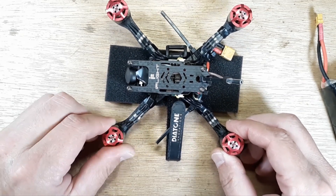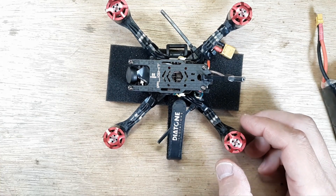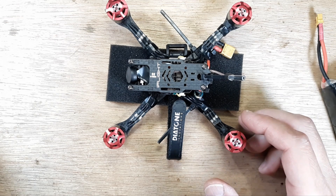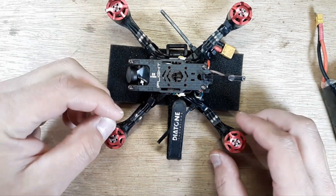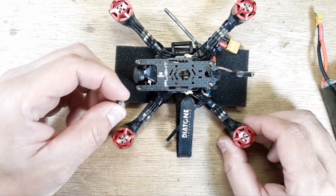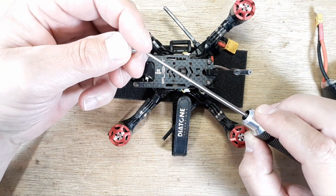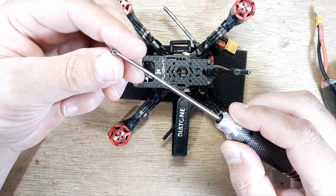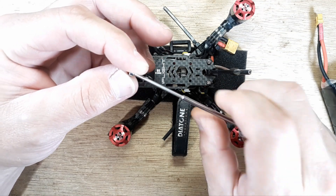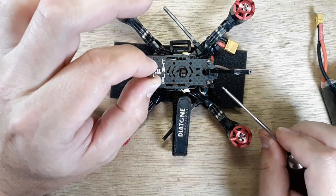You can't really feel a bad bearing just by turning the motor by hand — you need to bring it up to a certain RPM. Now when you take it apart, here's a bearing for that motor. Once you remove the bearing, you can put it on your finger or on a shaft about the right size and just spin it. You can feel in your fingers whether it's smooth — this is a new bearing and it feels good.